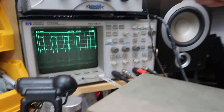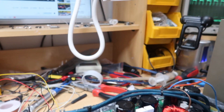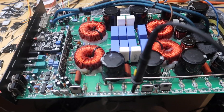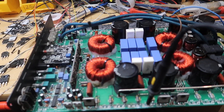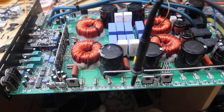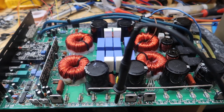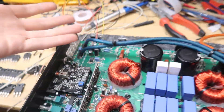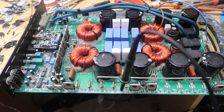You've got a sine wave on the output and it produces audio. Technically, if you fed this amplifier with even more voltage — plus minus 30 volts — and used a one-ohm load on the speaker terminals, you could actually use this amplifier indoors with a decent high-current plus minus power supply. You could just use a basic transformer from the mains, rectify it with a bridge rectifier or dual rectifier to get plus minus DC rails, and feed those into the amplifier's rails and regulator circuit with some heat sinks. This would produce audio just fine without needing the whole power supply section attached or any 12-volt power supplies.